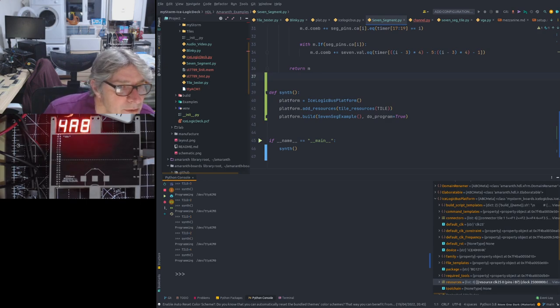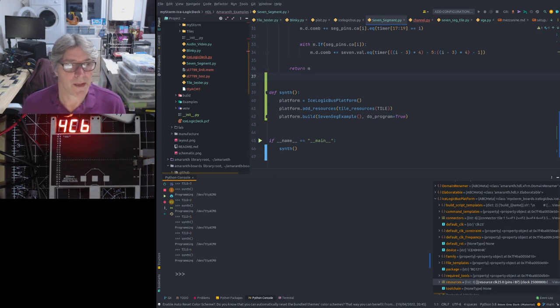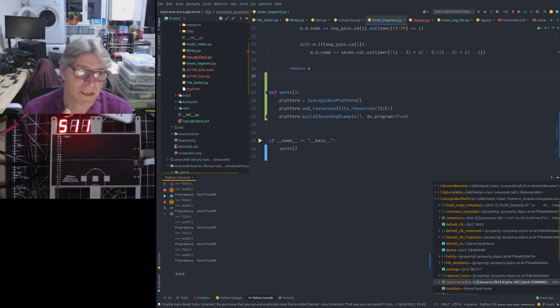So does that mean moving one of the USB-C connectors to the IRB? Yes, the power delivery connector. And that's all it will be, is power delivery. There won't be any data on that. It's just purely power delivery. No data. It's purely for power. It's a USB power connector that does up to 20 volts, basically. That's the idea. It's negotiated up to 20 volts. It's not data. That stays on the mezzanine, the data USB, the one that we're using right now.